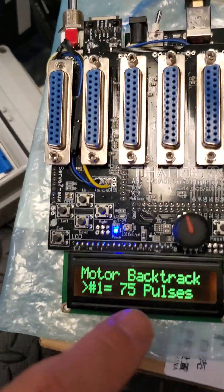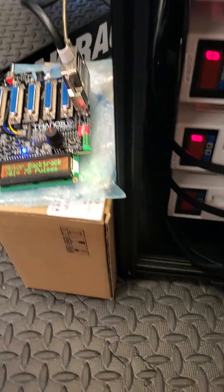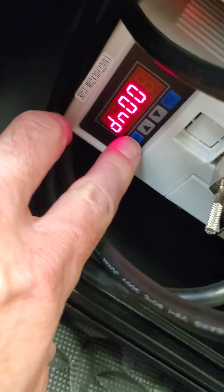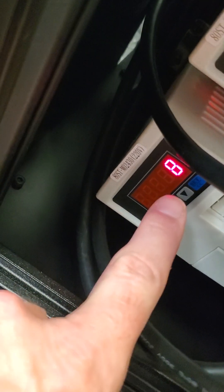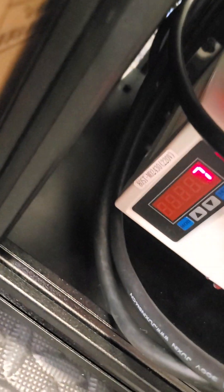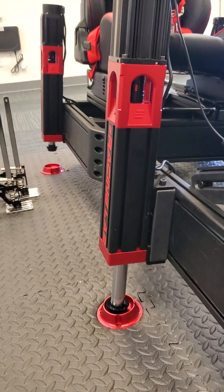So I'm going to be adding this in the next firmware — it's one of the things I'm adding. Also, if you want to verify the torque, you can do it by DN2, which shows the torque percent. If I move to the blue, it's now all the way up — it's holding all this load. The power it consumes is seven percent. You can see here on the power supply — it's sitting because the lead screw doesn't consume power when it's not moving, only when it's moving. That's why these are really efficient.